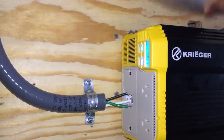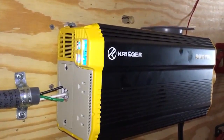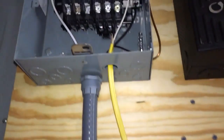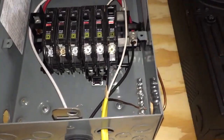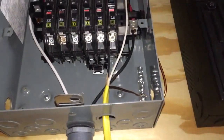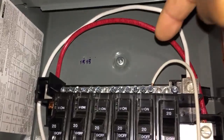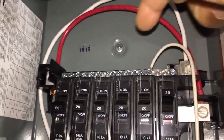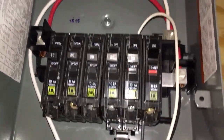There's just a little backup temporary system — I'm waiting for the Outback inverter to be installed. But this is hardwired protection, 4000 watt, connected into this load center. I hardwired it so the neutral goes here up into this neutral bus bar. This entire leg here will be all neutral bars, and the red is tying this end to that end — basically all of this is the hot.